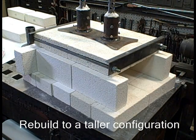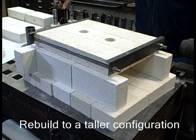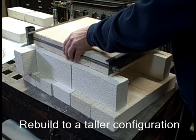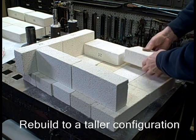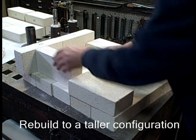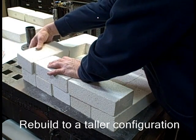If you're going to attempt forge welding, you need to put some kind of plate on the floor. That's a big area to heat to welding heat — I haven't tried it, but you'd put something on that floor, whether a thin hard brick, a piece of ceramic shelf, or whatever. You don't want to do forge welding directly on this soft brick — the flux will eat this brick.